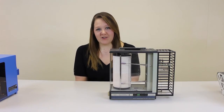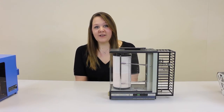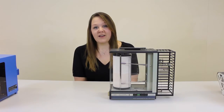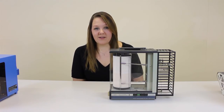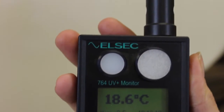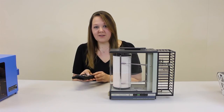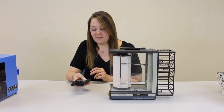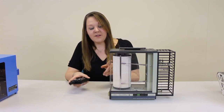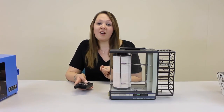You also may need to calibrate your machine. We do this because there's no point in recording data if it's wrong. Periodically, you'll need to check that the readings are an accurate reflection of what's happening in the space. To do this, you'll need another environmental monitor that itself has been calibrated. This is an example. If your museum doesn't have one, your local museum service may be able to help you with this. Firstly, you check the relative humidity — on this monitor, I hold and press the button. Then I compare the relative humidity from this monitor to what my thermohydrograph is showing and move the pens just by touching them if I need to. I repeat this for temperature.